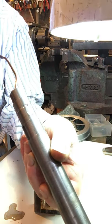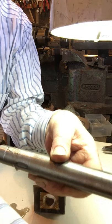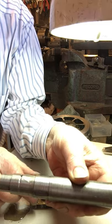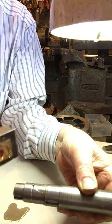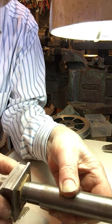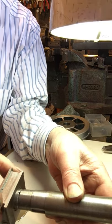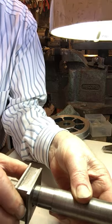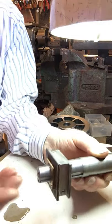Now that radial hole has a groove all the way around, and that groove allows the oil to go into the pad. So when it's all together and we squirt from here upwards — as we squirt in the end — the oil goes into the pad.